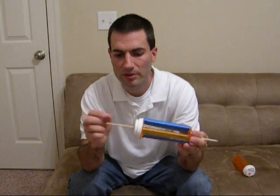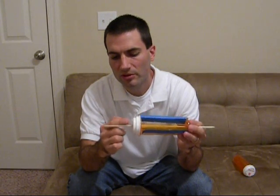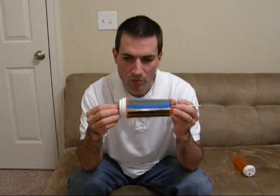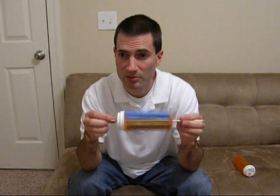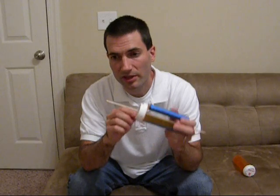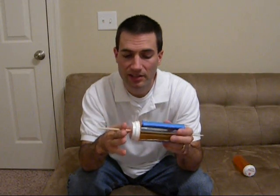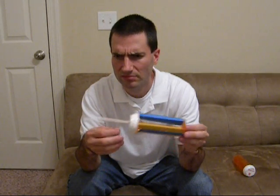So right off the top, I have three options. First, I'm going to try a treadmill motor with a pulley system — have the turbine motor there. Because it might be so light, I'm not sure how well that one's going to work, so I can try one of the ceiling fan motors and see if that works better. And if neither one of those are adequate for what I need, I'm going to go ahead and try to build my own stator and rotor — wind up the copper wire, use neo magnets on the other end, so when it spins it creates an AC current, then convert that to DC.